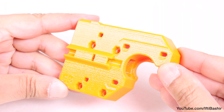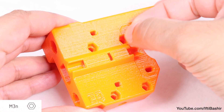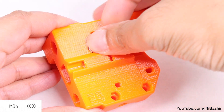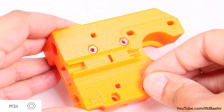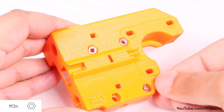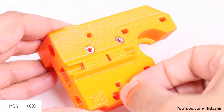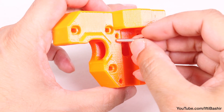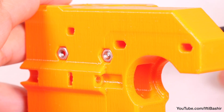the larger since the X-axis motor will be attaching directly to this part. Begin by inserting four M3 nuts into the four available holes on the back side. These nuts need to go down to the bottom of each hole. Bear in mind these parts are 3D printed, so try not to apply too much pressure since you could end up breaking the part. Instead, insert the nut, then use any M3 screw on the opposite side and tighten, which will in turn pull the nut down into the recess for you.